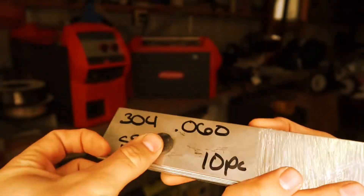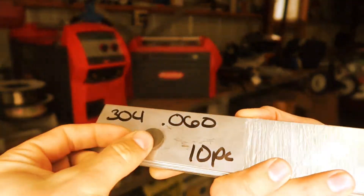Then there's 316. The second type is ferritic stainless, which is typically a 400-series base material. With 409, you have high heat corrosion resistance and strength compared to carbon steel, so the automotive industry uses 409. It's a lot cheaper than austenitic 304 because there's quite a bit less nickel content. Ferritic is magnetic.